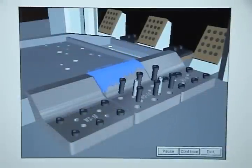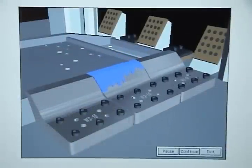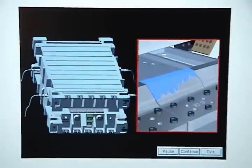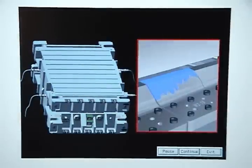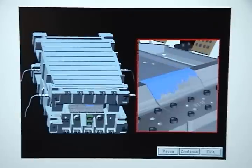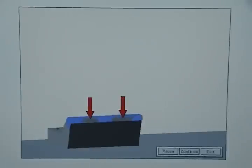Mount the trim steel back in the die. Place the lamina die separator lifting blocks on the bottom half of the die and have the crane operator replace the top half of the die. Then use the lamina die separator lifting blocks to lower the die until it reaches bottom, and then lift it off and inspect the repaired trim steel to see if any of the layout blue has rubbed off.